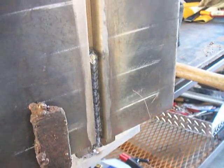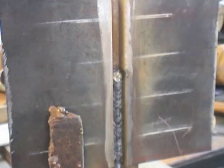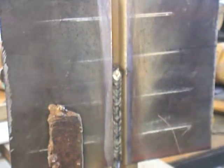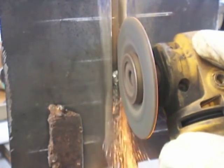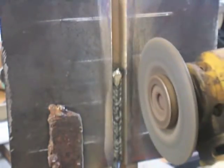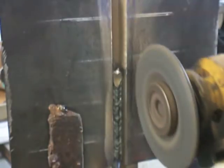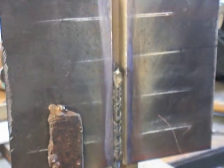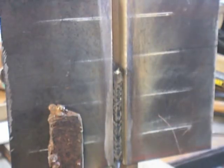Chip it, get all the slag off, and brush it real good. Tip number ten: if allowed — and you're not always allowed — use a grinder to clean up your tie-ins where you stop and start. Some tests lock up the grinder once the joint is tacked, but most times they recognize the grinder as a field tool and allow it. Use it to clean the back a little bit and give yourself more of an angle and area for a good tie-in, and to rake down the sides and blend out any slight undercut at the toes of the weld.